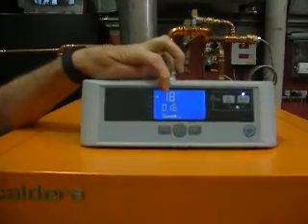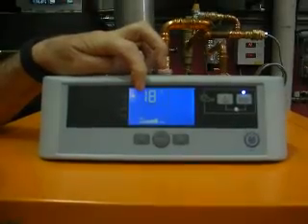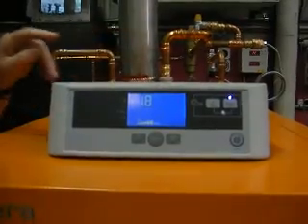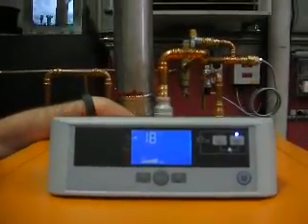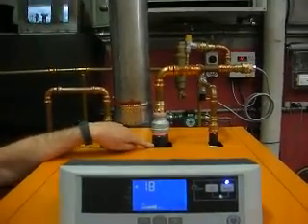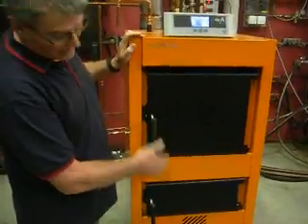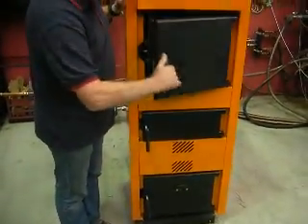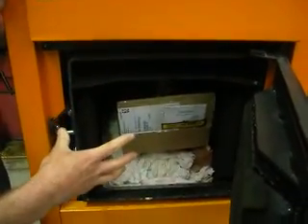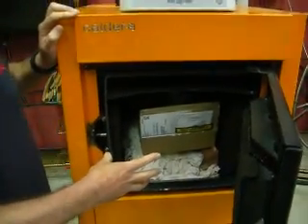This temperature here is the current temperature of the water in our system. In fact, that's the current temperature of the water at the back, at the top of the boiler, where there's a thermostatic sensor. So let's light this thing. We'll open the top thing up. This is a three door system. The top door is just here, and that's where our fire is going to be. And this would normally be where you'd stake the fire with lots and lots of nice dry timber pieces, once you've got a little bit of hot embers down the bottom there.